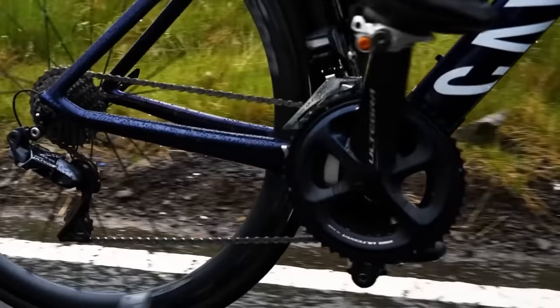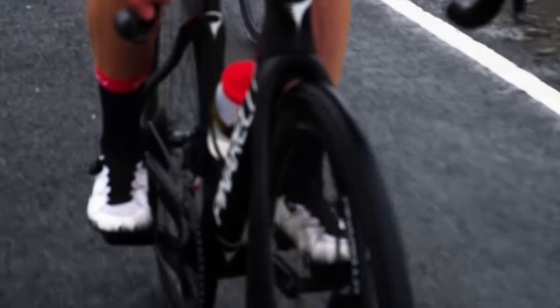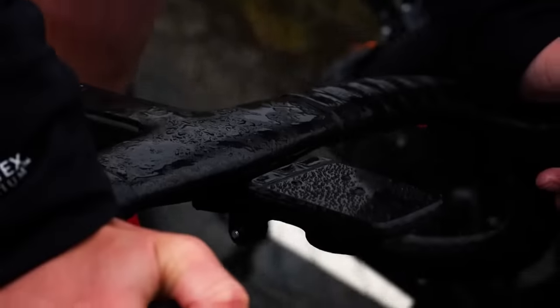But then, because I said earlier, fatigue is a mechanical process, it's about the interfaces also between the epoxy and the fiber. If you get moisture penetration into your composite, over time, that will also degrade the interface. It causes swelling of the epoxy, and both UV and moisture together will degrade the composite. So if your composite is exposed to UV and moisture, I would expect its properties to degrade over time.